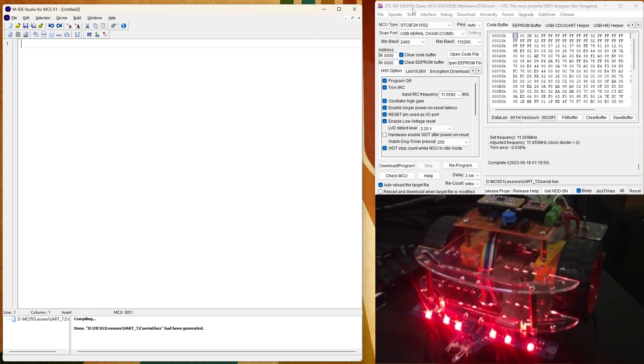The platform is in an elevated part so you can see that when I put my finger below the sensors, the LEDs respond. That means when the sensors find reflection — meaning the surface is white — the LED is off. When there is no reflection, the surface is under black, and the LEDs are on.